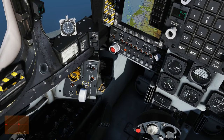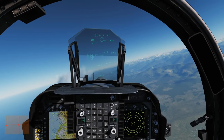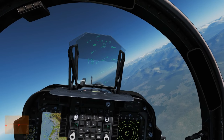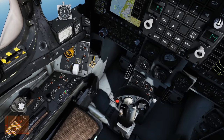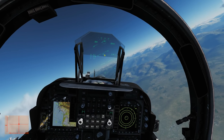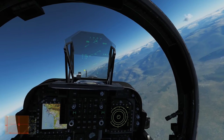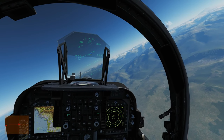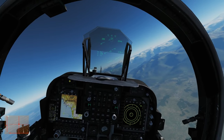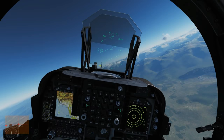Next, let's show that we can hold roll with the AFC. With altitude hold off, I'll put in about five degrees of climb and 45 degrees of roll and ask the AFC to hold me there. It holds me at just under five degrees pitch and holds the roll, so I can set it in a circle around a target knowing it will keep that climb and bank angle.